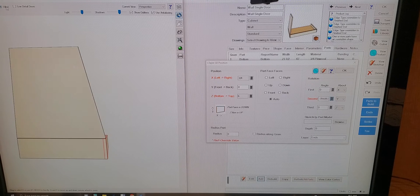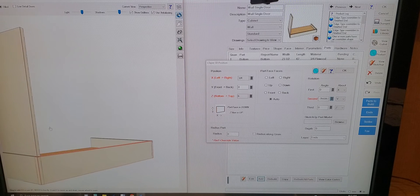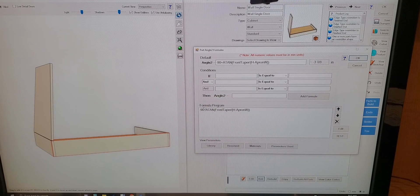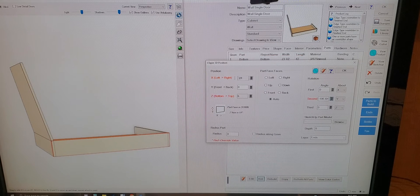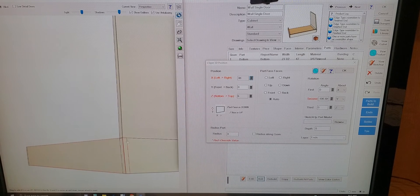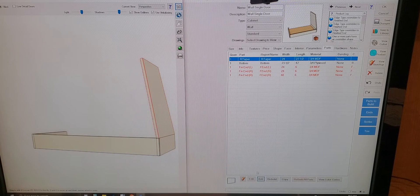There we go — we've got our one side. If you see right here, that's sitting up a little bit, so I'm going to switch this back to subtracting that, so it's tilting out. I'm going to actually just make this my right side, so left to right is just going to be 'width'. And there you can see where it's coming together nice and tight the way it's supposed to be. So I'm going to rename this part 'r_taper', and that one should be good to go.